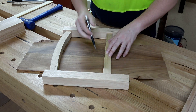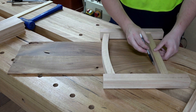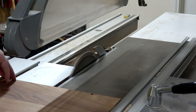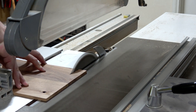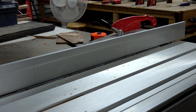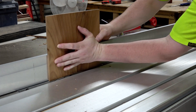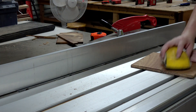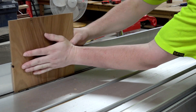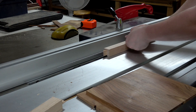I found a thin board of blackwood full of defects, and if I'm pretty careful I can dodge most of these defects, so I'm going to put these on the end panel just to give it a bit of flair and make it look good. I'll dock them to a rough length because once again I need to dock the curves into it and I don't know what length that will be. I'm putting a stub tenon on the bottom so that when I sand these panels later I'm not going to reduce the thickness of the joinery and make it loose.